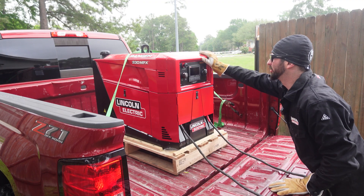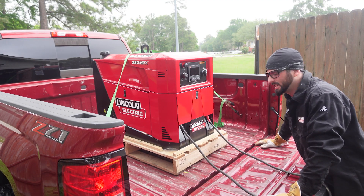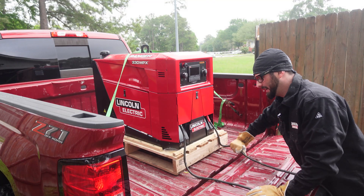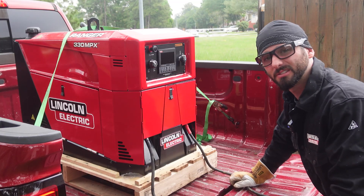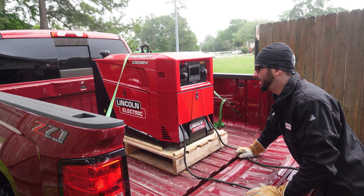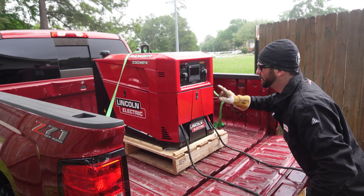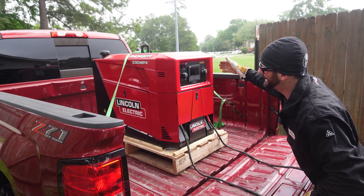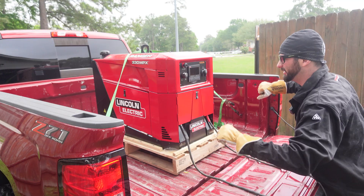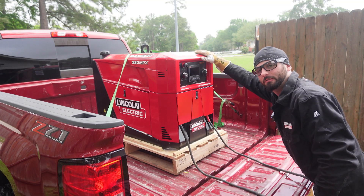I've got to say I'm pretty pleased with how this thing performed today, at least with the stick functions. I know it's got a lot more capabilities with MIG and TIG, and we'll need to upgrade to those other accessories to run those. I hope the lead portion of this video is helpful for you guys on how to put together your own set of leads. Now, 50 feet of leads — that may not look very far, and honestly it isn't. I'll probably take an extra hundred feet and put the connectors on it so I can take it on and off if needed. Past 150 feet, we'll just move the machine. It's a nice thing having something so small and compact. We'll get this thing off the wood skid next and put a nice metal skid on it with insulation reels, workstations — that's the next goal. Thanks for watching everyone, we'll see you on the next one.